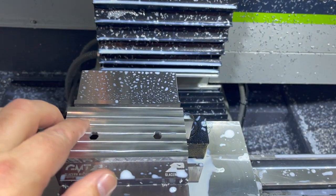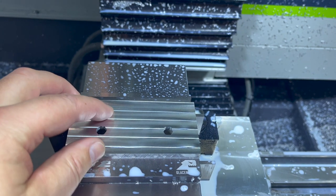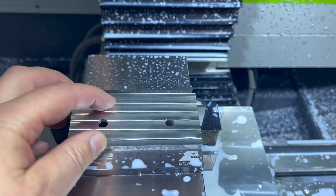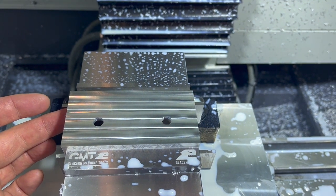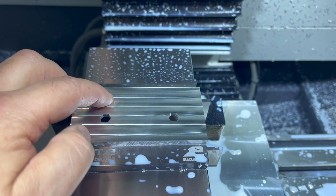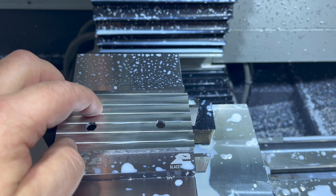All right, another little screw up in my programming. When I drilled that hole through from the other side, now that I added the countersink to the drawing, which I didn't have the first time around, when I drilled the hole, I let it just go to the bottom of the hole, which is actually gonna be where the countersink starts down there. So that hole didn't come all the way through. My countersink bit isn't designed to cut through the middle, so it really needs that starter hole.